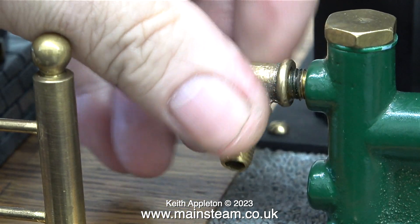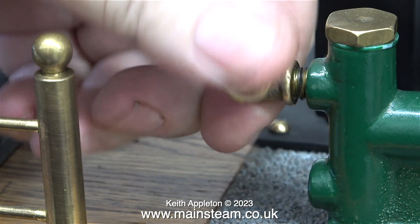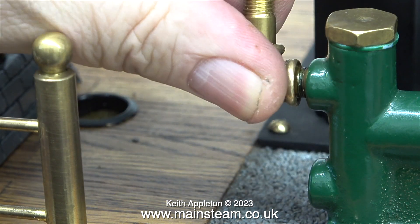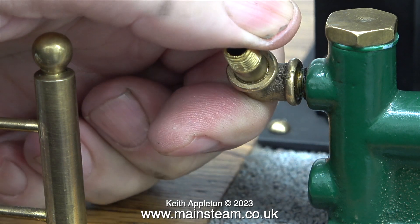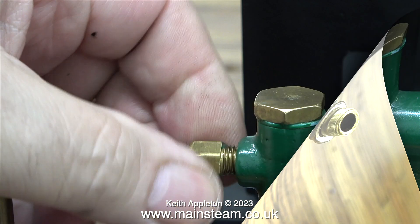This is a PM research pump and I'm going to use PM research fittings, but not this particular one — it's far too big. The pump itself is threaded 5/16ths on both the inlet and outlet. And when I use a 5/16ths elbow and another piece of 5/16ths pipe, the whole thing looks completely over scale and very ugly.